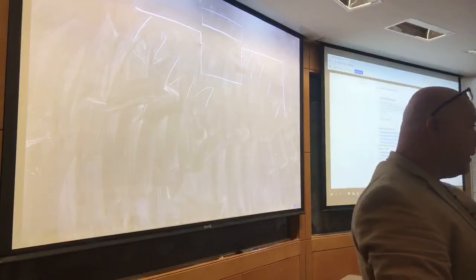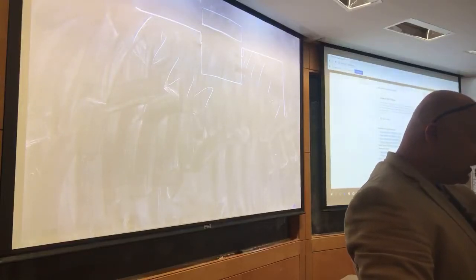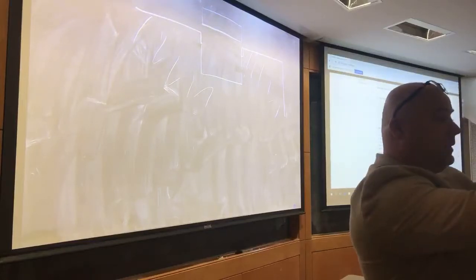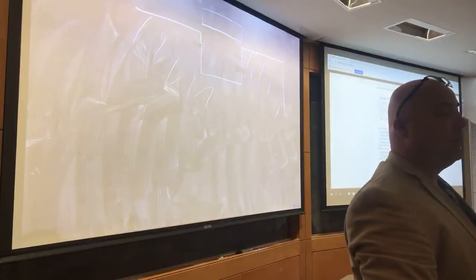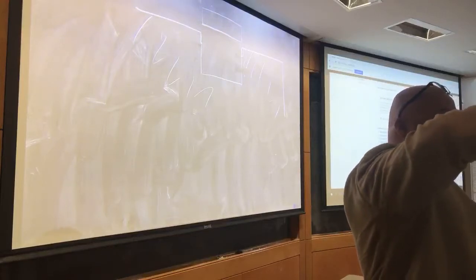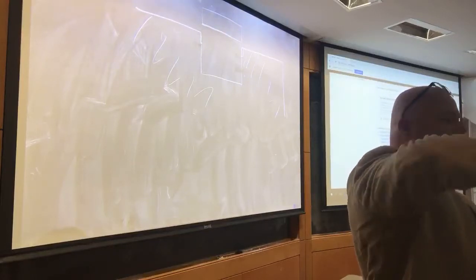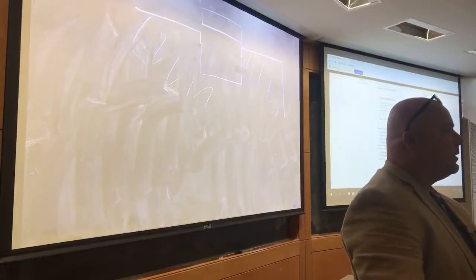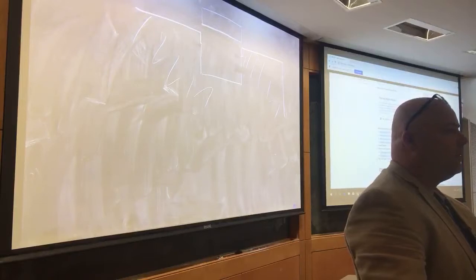Deep holes are difficult for a lot of reasons. Deep holes are difficult because it's hard to get the chips back out. Deep holes are difficult because the strength of the drill goes to, what's the deflection thing, right? And there's a length term in the deflection thing. And the length term is cubed.